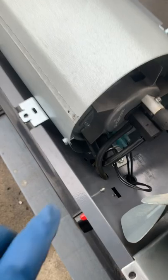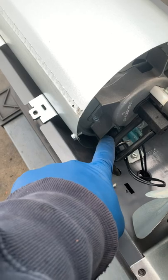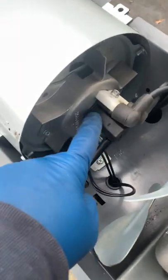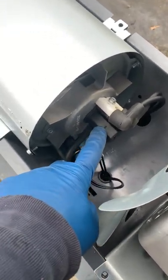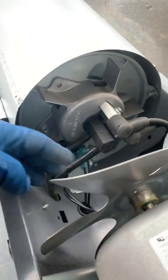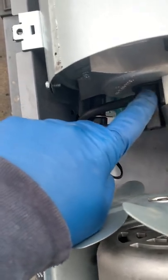I bought a photocell — that's this thing right here. It's like an eye that reads something in there and tells it to ignite the heater. This here is the spark plug and spark plug wires, and this is the nozzle. Since the photocell replacement didn't fix it, I decided to take the nozzle out and clean it. I knew I was getting fuel flow, but maybe the airflow was blocked.